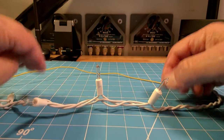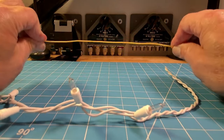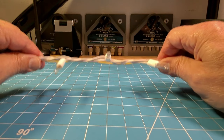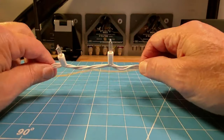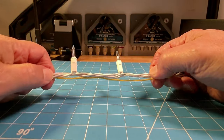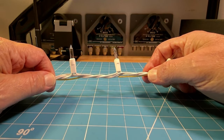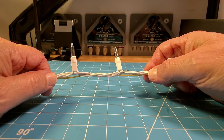So let's put up a separate wire — which is what I'm going to do. I'm showing it here in yellow just for contrast. Why not run our RF signal through this wire and then just put the lights over top of it? When I use white instead of yellow wire, it's going to disappear. Wrong again. The RF is going to transfer from this wire, and because the lights will be in such close proximity, the RF is going to get into them and light up the bulbs. We're drawing attention to ourselves again. And if you operate 100 watts single sideband voice like I do, these lights are going to pop to the fluctuation of your voice. That's how single sideband voice works — we peak with the peaks of our voice.